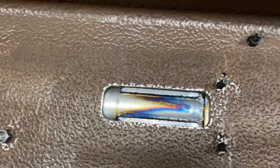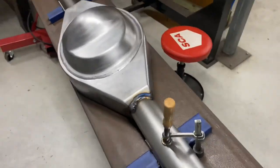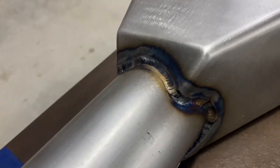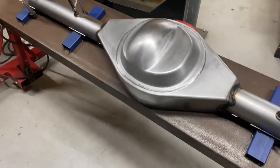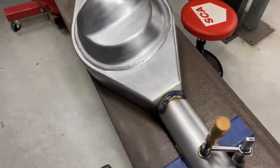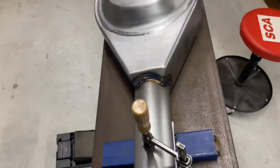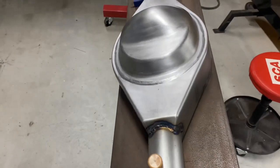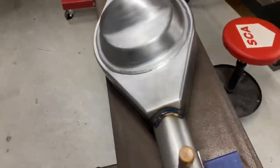On both sides there. If you're grey, that normally means you're a bit hot. You'll be able to tell if you're too cold because the weld stands really proud, it becomes a real dome. But as you can see here, it's kind of just moulding into the material really good. After this cools down and I wire wheel all that colour off, I'm cleaning it again for the second pass - we've got heated material just to build up. It's a great pass, the second one. I always do it on a pulse setting. I find it a bit more rhythmic with the second pass because I can listen to the tick - the tick of the hot and the cold, hot and the cold. That's basically how I play it out in my head: hot and a dip, hot and a cold dip. That's how I set my timing up and you can get really consistent results with that.